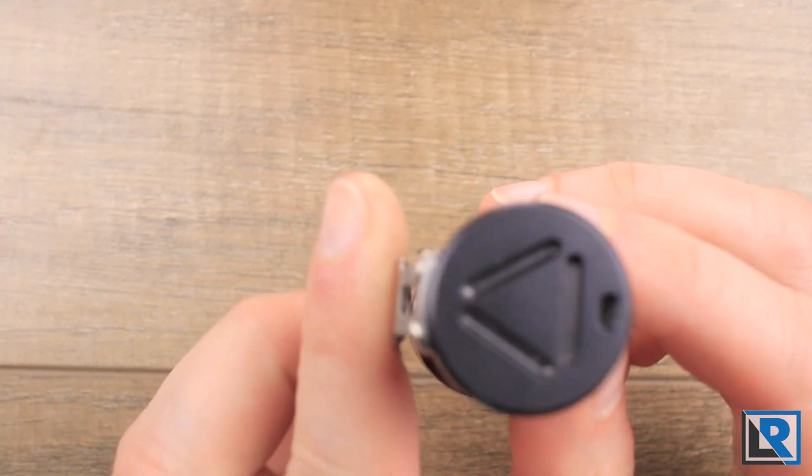Outputs were pretty smooth and similar, but at the 30-minute mark with the 18350 we saw very little steps and then the light flashed to let you know the cell was very low. However, instead of cutting off output, the light continued to run since the flashlight itself has no low voltage protection. My recommendation is to run this with a protected battery or charge it frequently. With the 16340 there's a lot of room left in the body; the 18350 fills the space nicely, though a protected or button-top cell may leave just a little bit of the copper bezel showing.